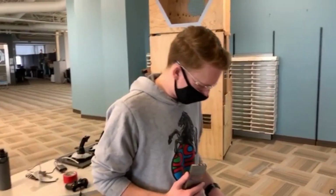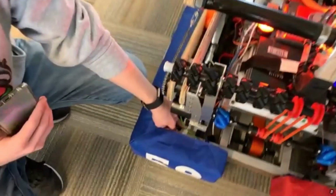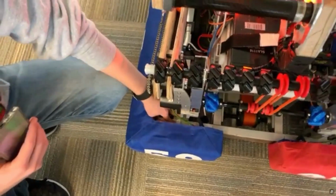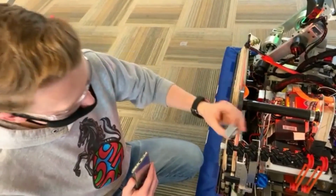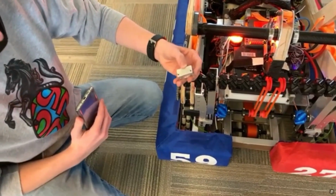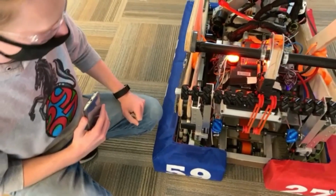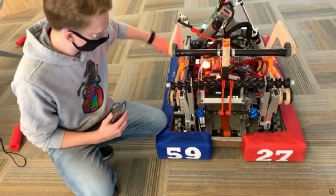All right, so with our chassis here, in each of these corners by the wheels, we've got these aluminum square tubes, and inside of those, to connect them strongly, we've got these little things we like to call dog bones. They sit in nice and tight in the tubes, and then we can just screw bolts straight into them, and they keep them nice and secure. And that's how they're connected on all of these corners and connections here.